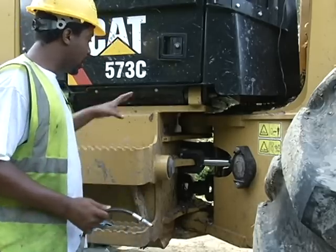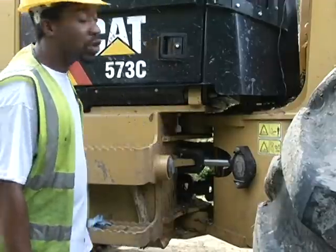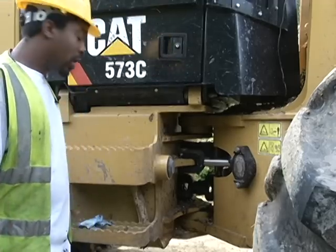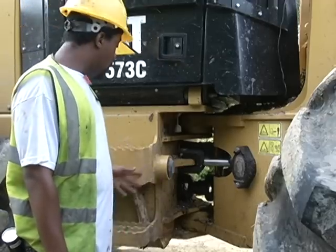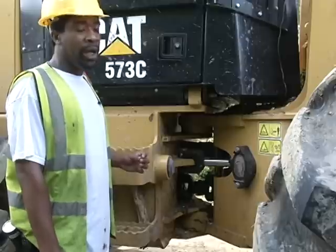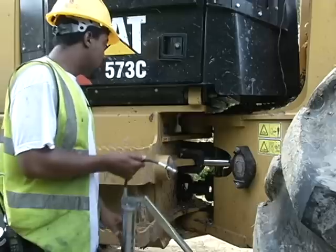I like to start in the middle because this is basically where all my grease fittings are. In the middle there is nothing past this articulation point. I start on one side, and I know when I'm done I'll be on the other side, and greasing for the day is done. What I like to do is I usually go ahead and wipe all the grease fittings off. You want to make sure you wipe the grease fittings off to make sure there's no debris or anything on your fittings that would keep them from receiving grease.